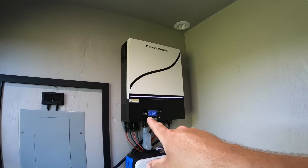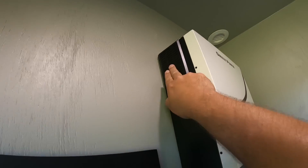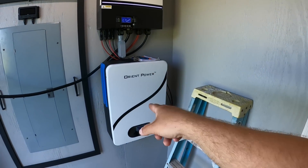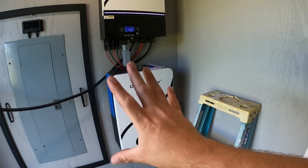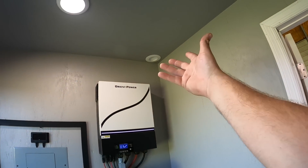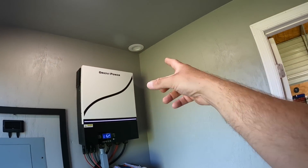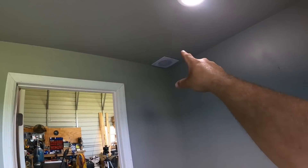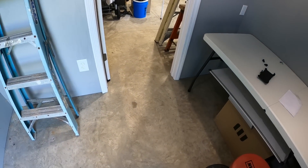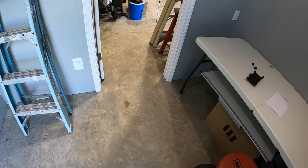Cold air is denser and is lower. I would like for that to pull up — hot air rises in the room, and that's why I have the vent over in a corner, especially by where the inverters are. Inverters pull air in up top and exhaust it out both sides. We're eventually going to have another inverter — I think it's going to go right where that battery is — so I'm going to have a lot of heat in this corner. That's why I wanted the actual air intake for the fan to pull from over there and pull the hot air out of the corner. Cool air is going to come in from up there and underneath the door, and both of them are filtered for large dust and debris.